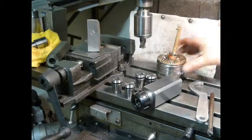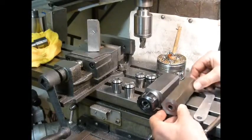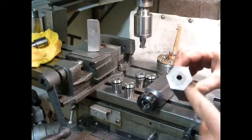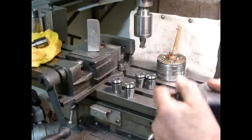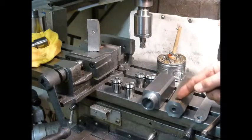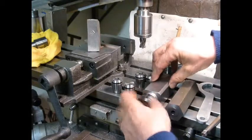So that's the operation of the square unit in a nutshell. The next project is to build a hex version of the same thing. This is a piece of hex bar that I intend to copy the square one with. I've already drilled this piece of bar end for end. The next step is to bore it out to the diameter of the small end of the collet, then thread this end of the bar and bore an 8-degree taper in the end — and we'll end up with a hex version of the square one.